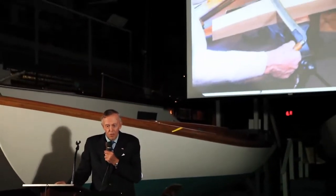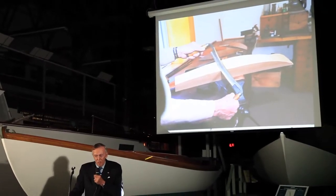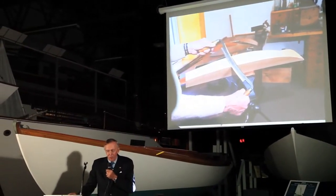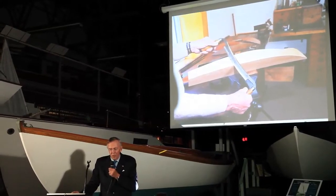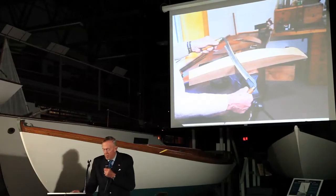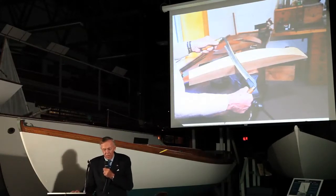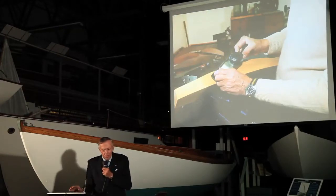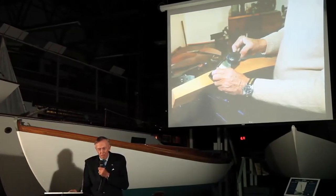Now I'm going to show you how we use these tools. Here I'm using the drawing knife — it's a great tool because it has a little width to it, which also helps with fairing as you pull it toward you, and it allows you to cut very quickly. That's a good way to start out. Then using the block planes to go to the next step — getting off material pretty quickly but without getting into the final details.